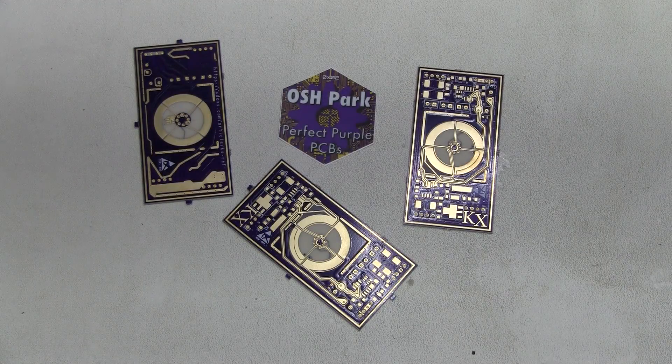And here is what I am getting myself into. I just ordered 3 boards — the minimum order — for a voltage reference based on the LTZ1000 chip. This is just the start of an endless pursuit of perfection, and I am at serious risk of spending a lot of money and becoming a volt nut in the process. I have already ordered parts for one board; these are expensive parts, certainly more than 100 dollars to build just one board. This reference, if done properly, should be so stable that compared to the graph we have seen it should produce a straight line — given a good voltmeter as well, of course. So this is going to be a topic of one of my future videos.